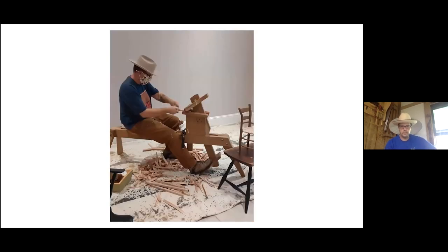Here is me at a museum demonstrating the shave horse. That's typically what I do these on, but you can also use a vise in your bench — there's nothing wrong with standing up and doing this. Sometimes I take a break from the shave horse because over time you develop bad posture from just sitting there. Everything you can do on a shave horse, you can do in a vise. It's just a clamping mechanism — my foot pushes against a lever which clamps a spindle or stretcher at the top, and I'm reducing those in thickness with a spokeshave.